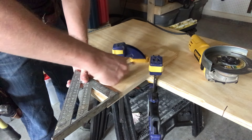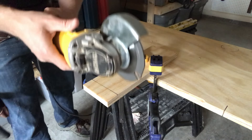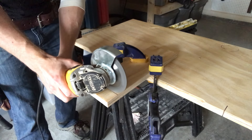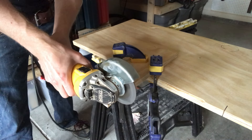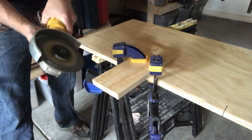When cutting wood, I think you should always mark a cut line — it gives you something to follow. Then be sure to hold the tool with both hands out in front of you. The best way to make these cuts I've found is to use the blade guard as a pivot. You can set the bottom edge of the guard on the material you want to cut, then use it for stability as you slowly rotate the blade down into the stock.